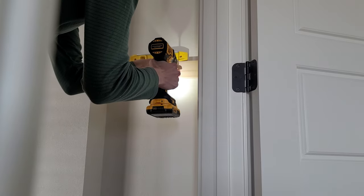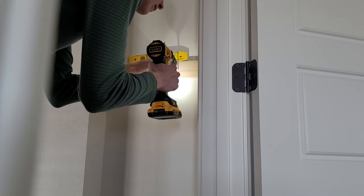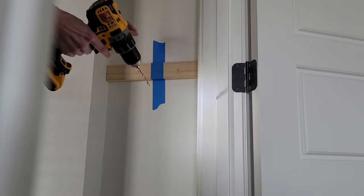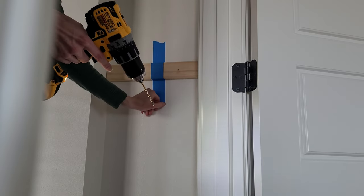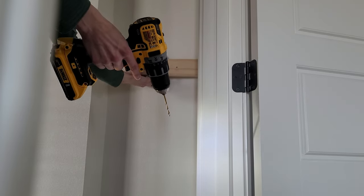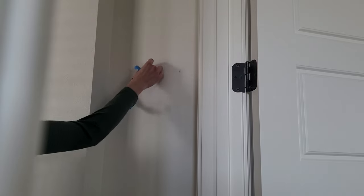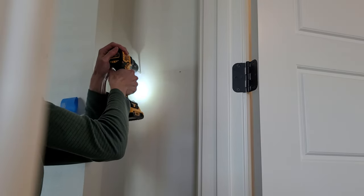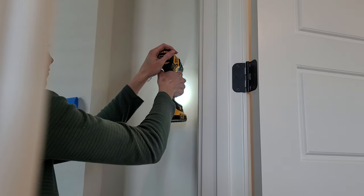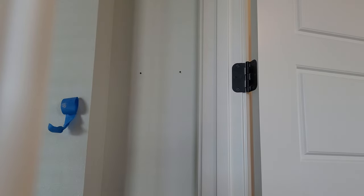To attach the board I went ahead and used wall screws. I checked ahead of time to find where the studs were — I didn't find any on the right, but on the left hole I did run into a stud, so I only needed an anchor for the right side. I used screws that I had — probably about two and a half inches — and a really strong drywall anchor. But I'm just hanging blankets, and the board is also going to be leveraged in there, so I didn't feel like I needed super strong anchors. I like to start with a tiny pilot hole and then use a larger drill bit to more closely match the anchor — obviously not bigger than the anchor because it needs something to grip on to, but I also don't want to start cracking and breaking up the sheetrock.